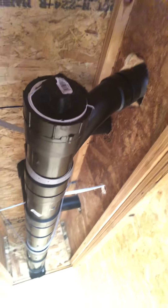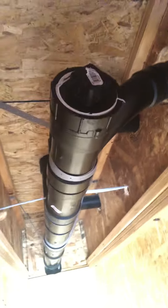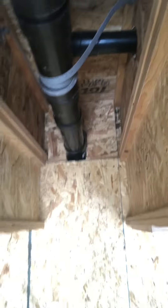This fitting is for a shower — notice it penetrates back and forth between two floor joists — and then there's an associated vent. Every fixture needs its own vent. And then for a toilet, you can see the toilet waste pipe and its associated vent. This runs down — it's really hard to do in a tight space.